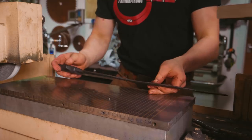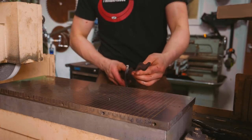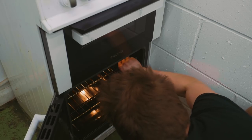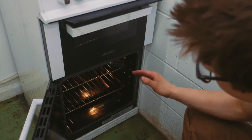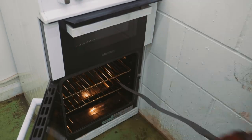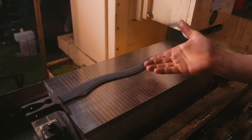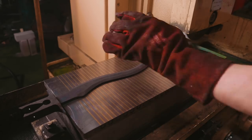Now we're going to temper this. I'm going to see if it'll fit in the oven, and if it will, once it's up to temperature I think we're going to try and lock it on the mag plate and see if that straightens it. Maybe it does, maybe it doesn't. Worst comes to worse, we go for attempt number four with the hardening. Maybe I can shim it — maybe that'll better straighten the warp. Who knows? We'll find out.